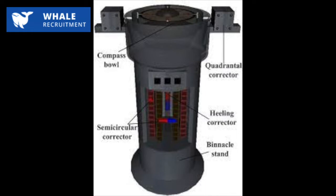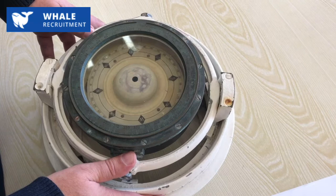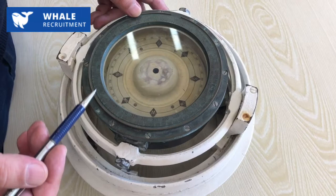All of this is placed in the binnacle, which has a system of magnets to fight deviation. I suggest you not to touch these magnets unless you are specially trained, because it causes major errors for the compass.